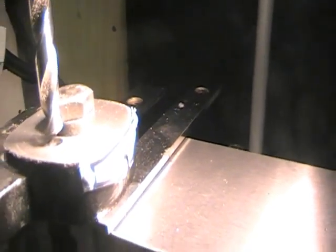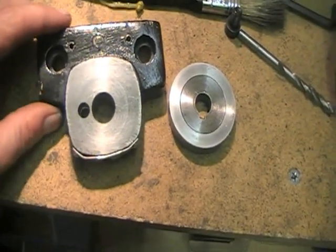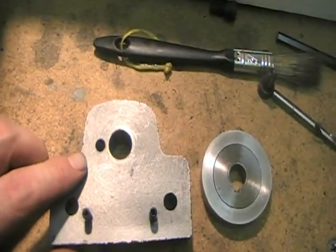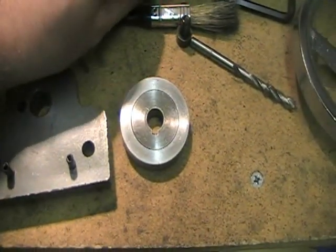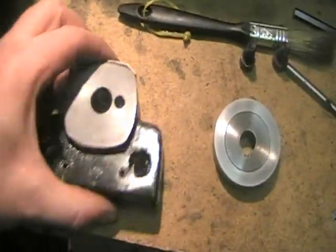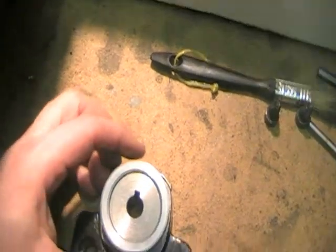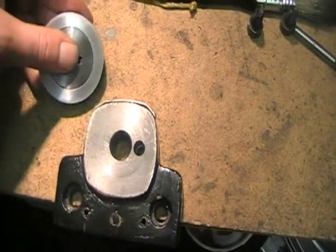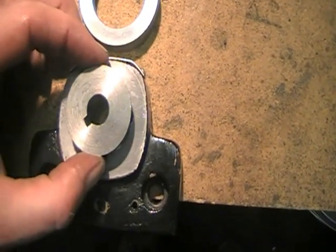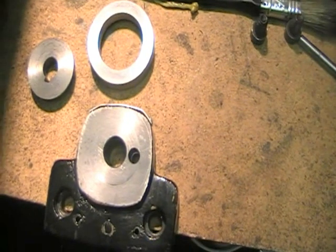I'll have to do that off camera because I've got to use two hands. I've gone halfway through — about 12mm — with the 8mm. On the other side that's where the thread's going to go, so that's 6.8mm — I'm going to tap that to 8mm and make myself a little grub screw out of an 8mm bolt. On these you've got the little measuring outer ring that sits on there. You can see the outer bit which actually comes off, and the ball bearing will just sit on this inner bit so I can adjust the tension to accommodate that free play.